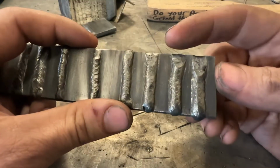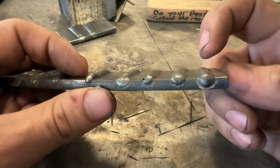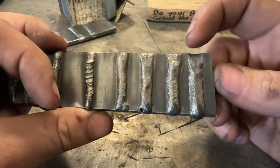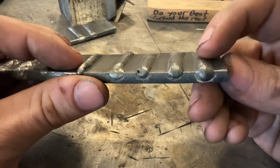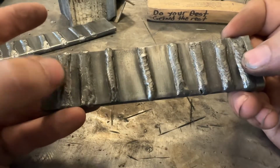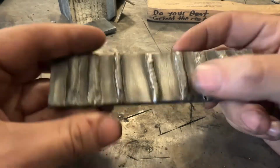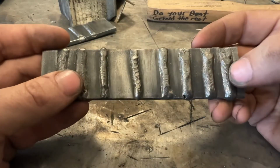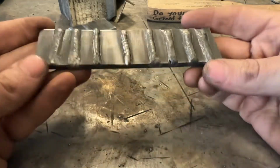And then let's look at these two beads again. Higher heat input than this, and also more wire feed. If you look at how much bigger that weld is than that. Is this an acceptable weld, both of these for 1/4 inch? I would say yes, this being bigger than that. Overall, like for 1/4 inch, if your welds look like this, you're doing pretty good. If it's the 3 in the middle, 2 roped up, etc. But these you can fine tune to get exactly what you want. These you need a lot of work on to get those in line.